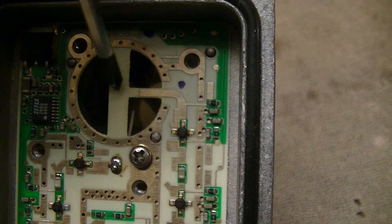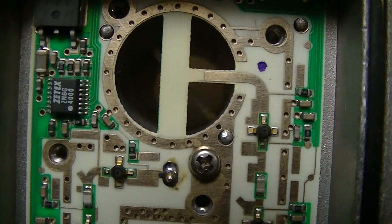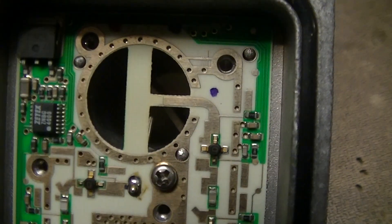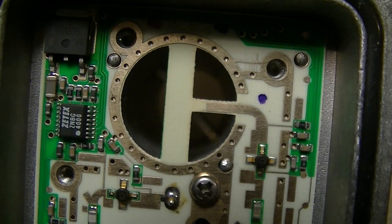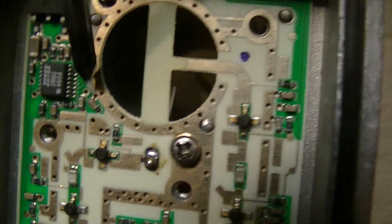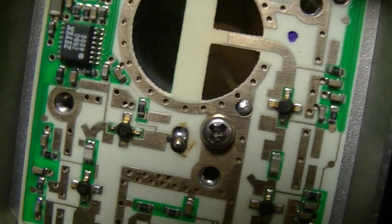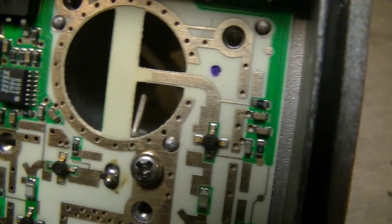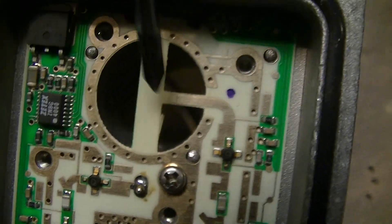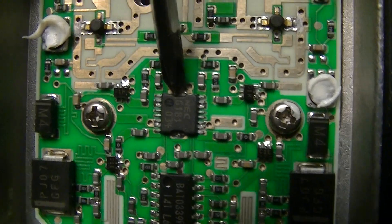This trace on the PCB and that wire in there are the two antennas. It appears that this one is for a satellite signal that has two different components at roughly 90-degree polarization to each other. That one antenna being canted is due to the way it was assembled — so that's probably deliberate, or it doesn't have enough of an effect to really screw things up. There are two separate antennas for two different components of the signal, which are then switched between the two by this device.